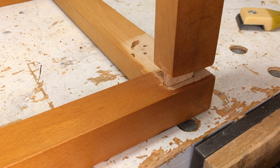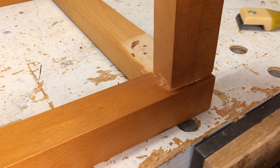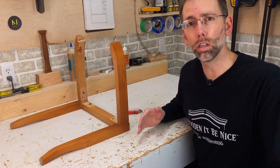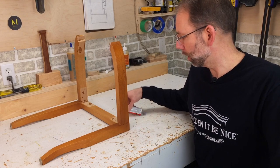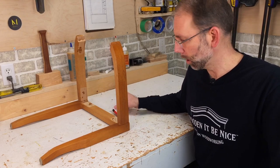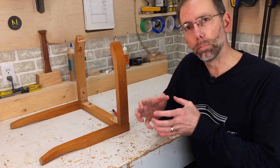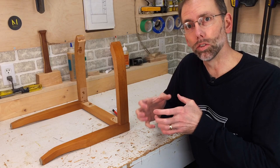So this is where we need to talk about glue. The right type of glue to deal with this joint is not wood glue. Because this mortise and tenon is loose, there's really only one glue that will work with that, and that's epoxy. Mixing that up and putting that in there fills the void — but not only fills the void, when it cures it bonds and makes sure you've got a tight joint.